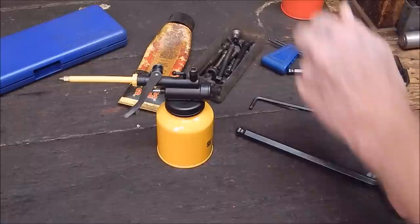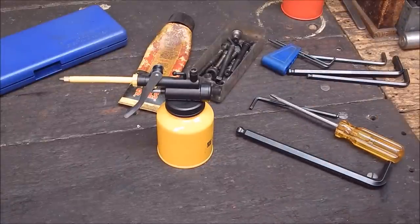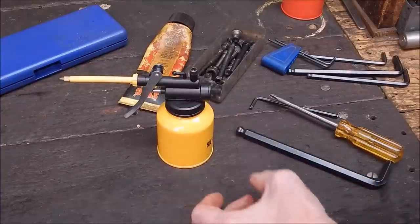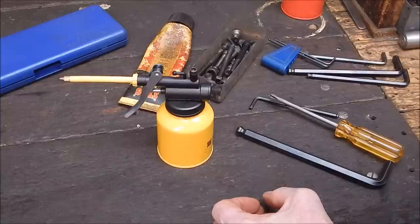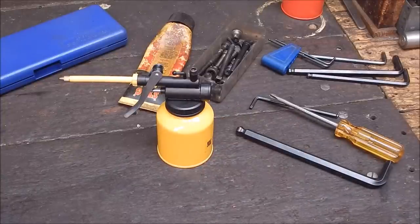You could actually probably use it straight away because it won't move. That's basically a really heavy old-style gas fitting and petrol line sealer. The only thing that will actually dissolve this is methylated spirits or acetone, but it's totally impervious to fuel — yeah, it's a good sealer, as old as the hills, as they say. Okay, well, that's it from me. I hope you found it interesting — it's all fixable, it's just a matter of spending a bit of time. And once again, you can see what's inside these — not much at all, really. I think it's going to last quite well. Okay, that's it. See you next time. Cheers.